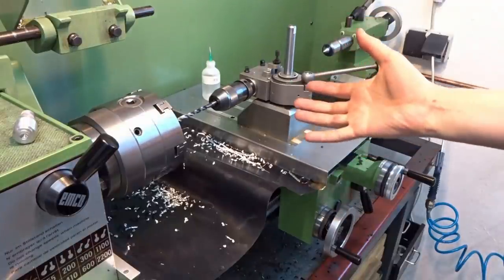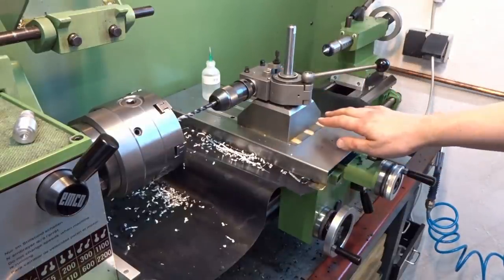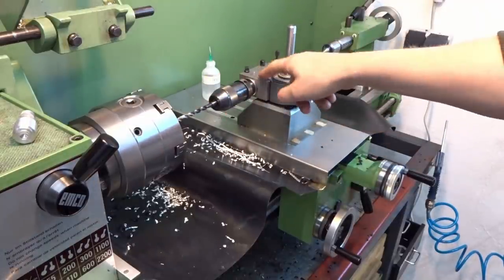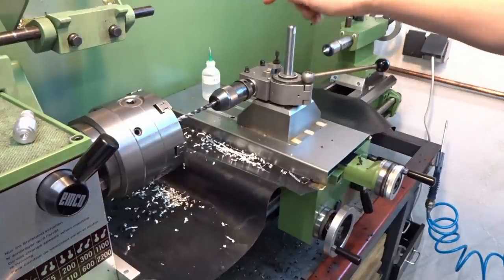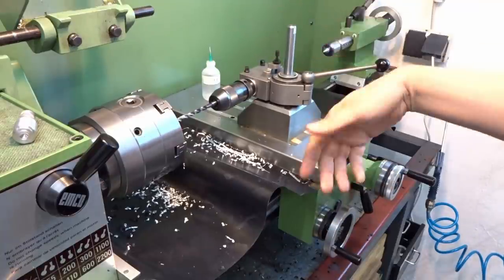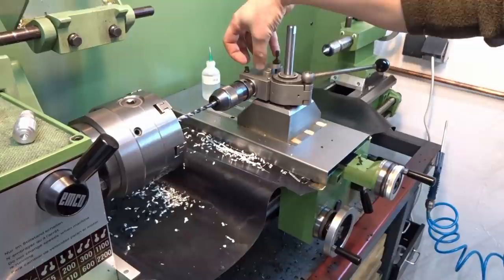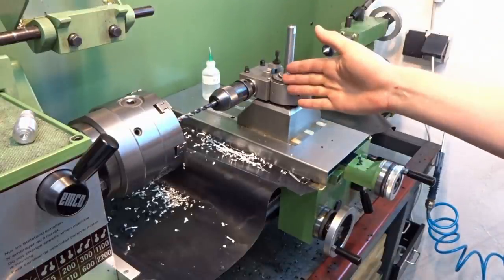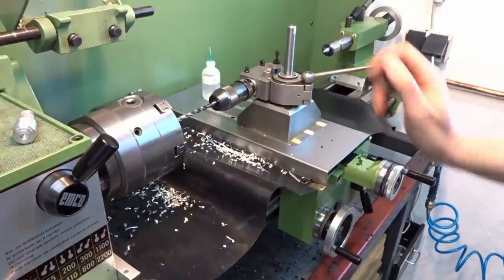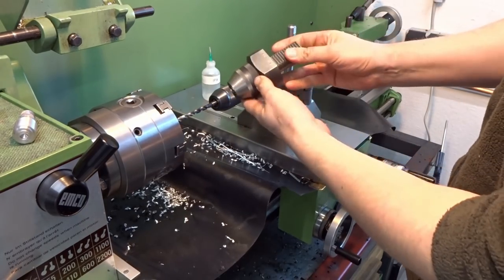What you see here is basically my standard setup on the lathe - no compound slide, a solid tool post, quick change tool holder, and in this case for drilling I have a keyless chuck in a Multifix boring bar holder. Most systems for quick change tool holders will have a way to either directly mount a drill chuck like the Aloris tool holders - they have one with a keyed chuck - or in the case of Multifix or Parat tool holders you have a boring bar holder with a more stable sleeve and you can put a drill chuck in it. Or if you're extra fancy you get a CNC drill chuck like this.